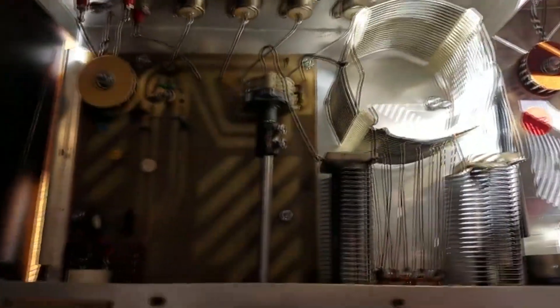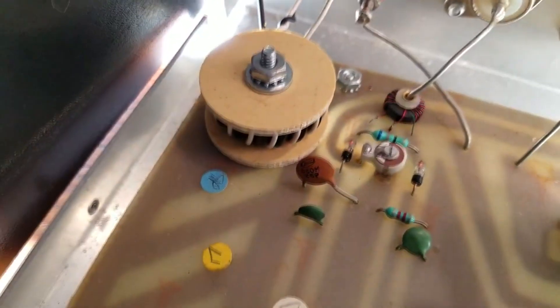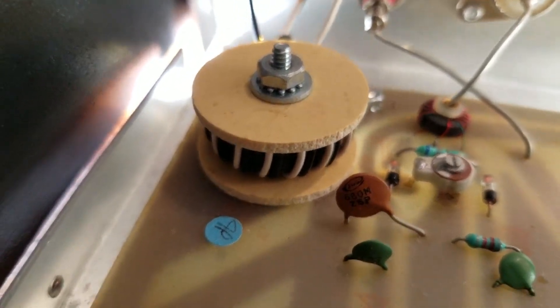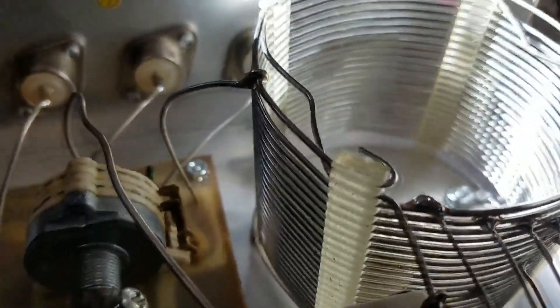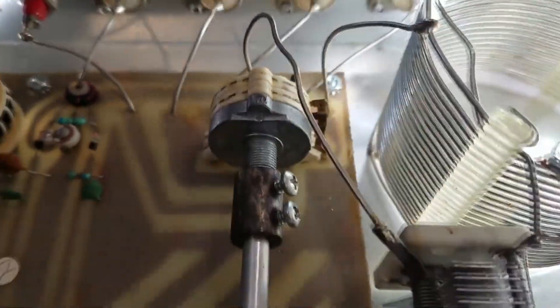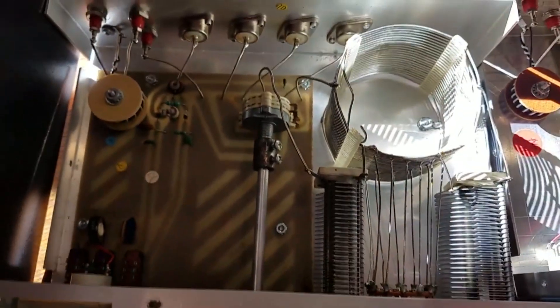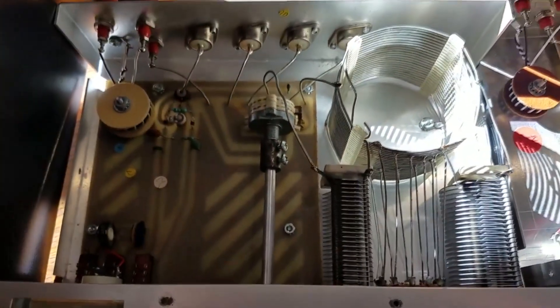Looking inside the old 941D — we've got a big board, a little micro balun, even though this tuner is rated at 300 watts. If I was going to run through the balun with my antenna way off, I wouldn't go with more than 100 to 150 watts through here. Panel mount connectors are riveted in on this one. There's a big coil with taps and a nice little selector switch — very simply made. When I first bought it, I found a little ball of solder in the corner, and I touched up all the solder joints back in the nineties.